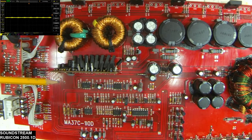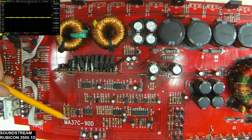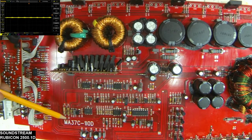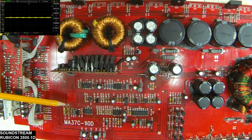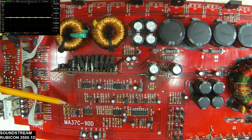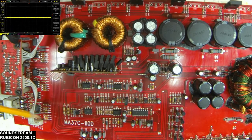You will see R66 here — this is common on these Rubicon 2500s that it gets extremely hot. Some boards I will take R66 and upgrade it to a higher wattage resistor. It just depends on what the customer requests, because like I said it does get hot and it may swing value just a little bit, but this does drop a ton of voltage across it.